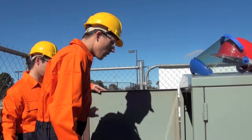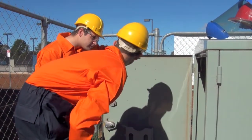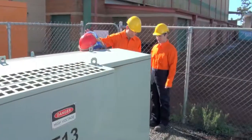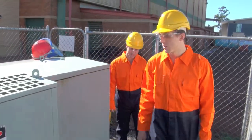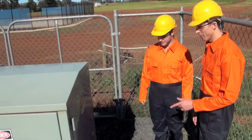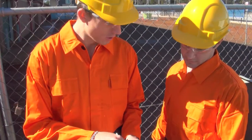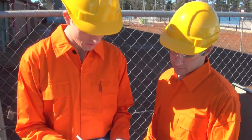Once this switch or breaker has been identified, hang the "Isolate Here" sign on the disconnect switch. This will enable a rescuer to quickly identify the switch and de-energize the circuit. This task should be undertaken in conjunction with any required risk assessment. This shall be done according to the task and also the site.